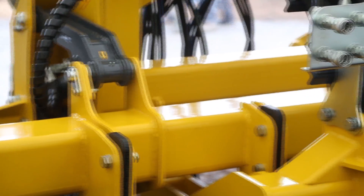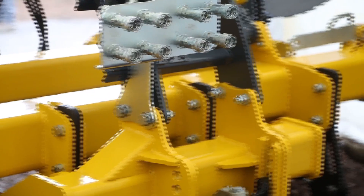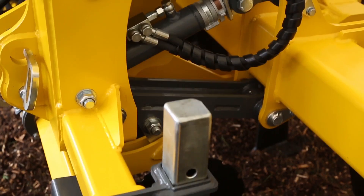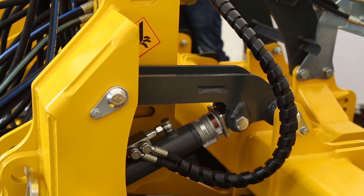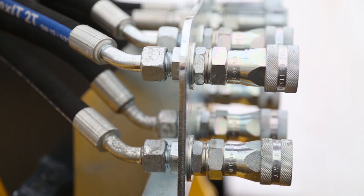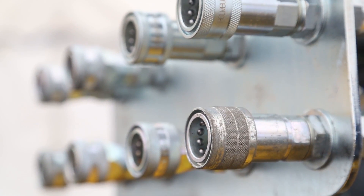With regards to the toolbar itself, which we offer in three, four and six, it becomes a very versatile machine. The idea is that you can hook it on the back of a tractor and trail any form of implement behind it, whether it matches the actual width of that machine or not. You fix the height on the three-point linkage of the tractor, and after that all you're moving is a hydraulic service, which moves the toolbar up and down into and out of work.